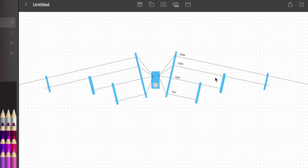So then these are going to be the little 10 inch pieces. We're going to space these out 6 inches each. According to my research, I found a couple different places that 5 is kind of the magic number. And then sometimes they'll do different angles on them. But I'm just going to space these out 6 inches to kind of get them away from each other a little bit. And hopefully they won't detune each other as much.